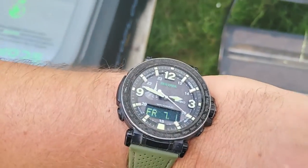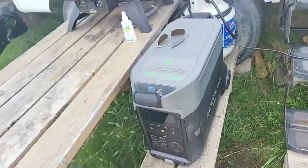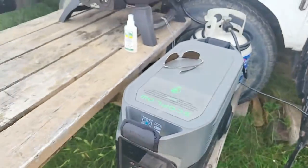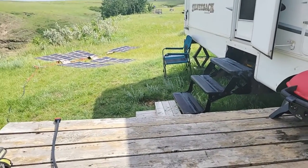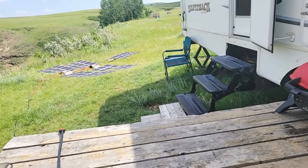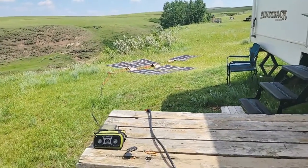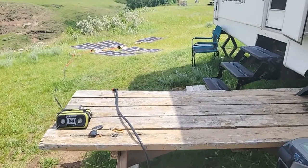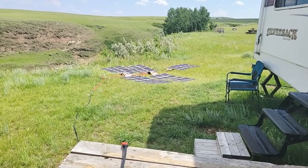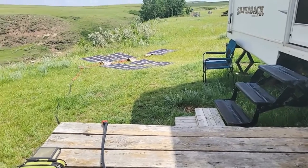Today is July 1st. We are almost 10 to 3 at 51 degrees North latitude, so the sun's not the highest on the horizon. We've had a lot of customers contact us — they've seen our videos where we have a 200-watt solar blanket out and we're producing 200 watts. I just want to point out to everybody, because I want to make sure there's no false expectations: you don't get that all of the time. Right now you're getting an idea based on where the sun's at and where we're located.